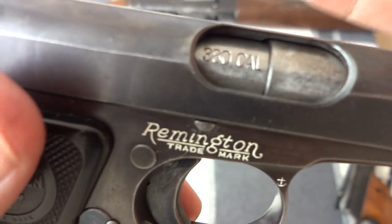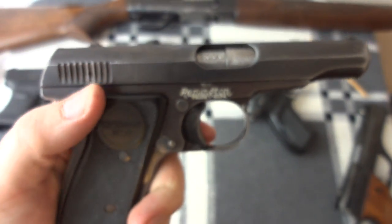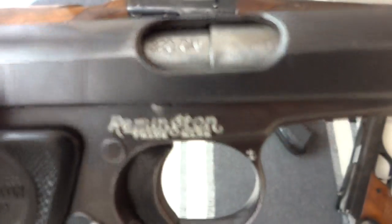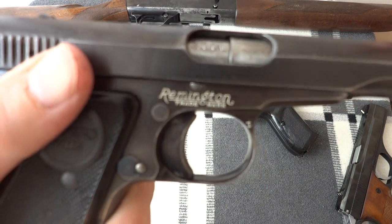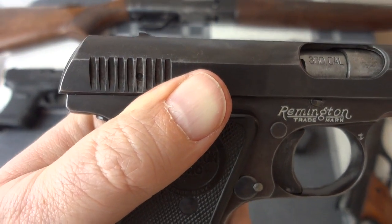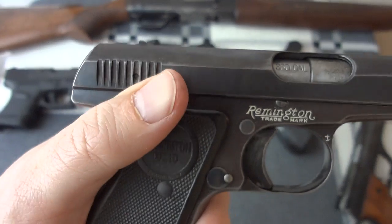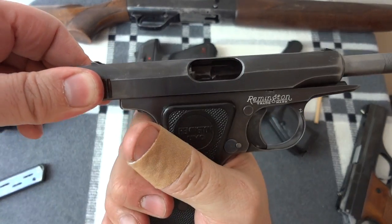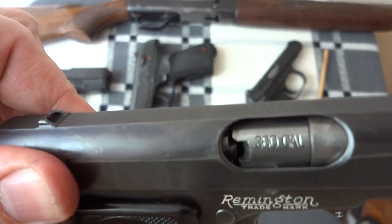Now during that initial shove, the firearm is operating in blowback mode. So that initial energy that's given just to the slide, the barrel isn't moving. Look, the barrel is fixed. There we go, fixed barrel. The slide's moving, but that little itty bitty movement there is what is causing the slide to gain enough velocity that it will continue to the rear and extract a cartridge and continue with the operating cycle. Notice the barrel remains fixed through the whole thing.